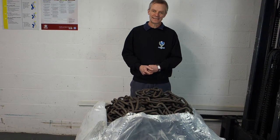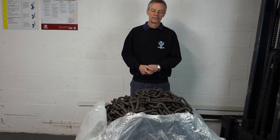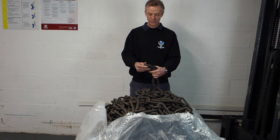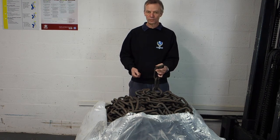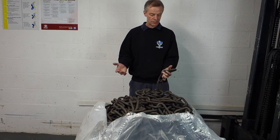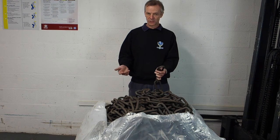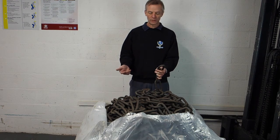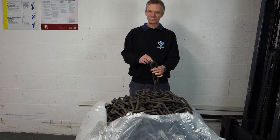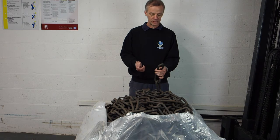The heat treatment itself is done in computer controlled furnaces and after heat treatment the chain tends to look like this. Ordinarily this would now go on for shot blasting before final finishing and creating the final product. This particular load is 300 kilos and it's a rare example where that computer controlled system went wrong — we've ended up with the case about 30% thicker than it should be, as revealed by the lab test.